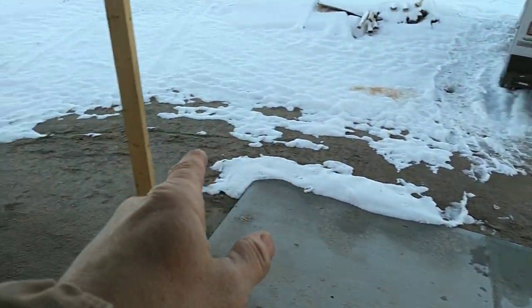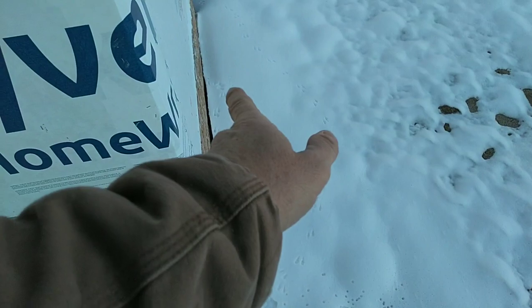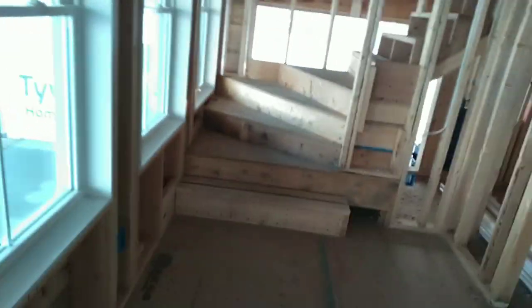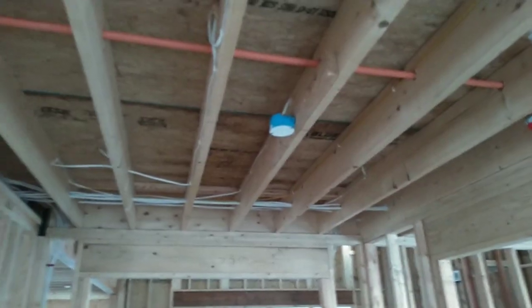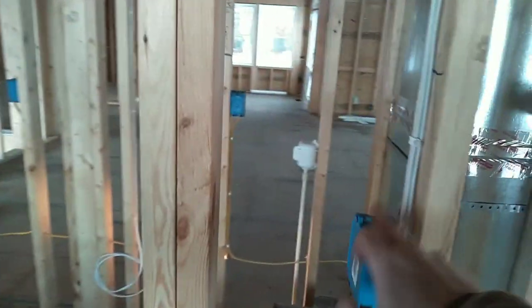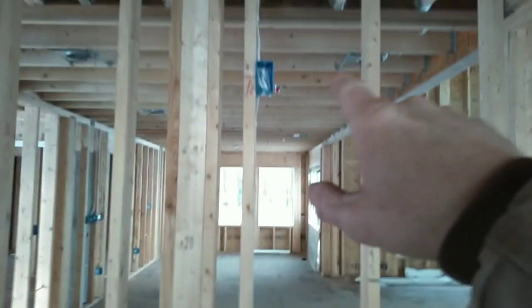If it is a GFI issue, it'll trip right here. I choose to separate the two so that a GFI issue doesn't trip the whole lighting circuit. The post lamp stake wire is coiled up, and the trench cuts all the way over here, comes in on about a 45, and goes into the side of the house. One switch is for a can light, one's for a smoke detector, one for the overhead light, one for the four can lights outside. This is the light switch for the mechanical room slash coat closet, and the wire coming from that box down is for the gas furnace switch plate. The gas furnace is going to sit right in here.